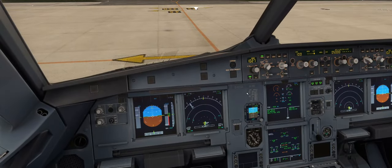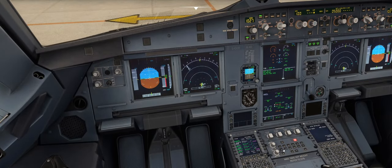Wind clear to start — we've got our ATC clearance and we've checked that the area behind and in front of the engine is clear. We'll adjust the idle level of the supplying engine to provide at least 30 psi of pressure. We've got our PSI here; we are at the moment at 30 psi. Once we go through the start procedure that may drop, so we need to keep an eye on that — we want to maintain at least 25 psi during engine start.